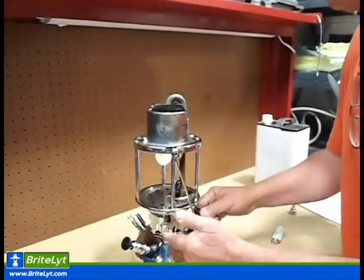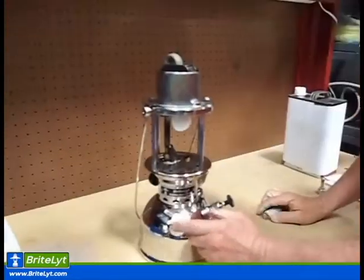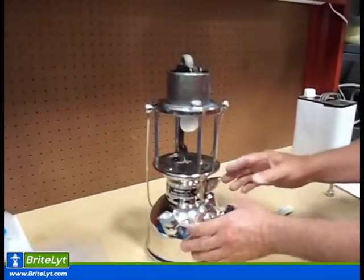Let the pressure off, shut your preheater off, shut your knob to 12 o'clock. The problem with low pressure will be the same as not preheating it long enough — it'll be insufficient and what we'll end up having is a flame up.